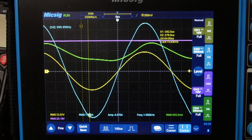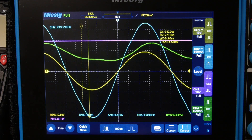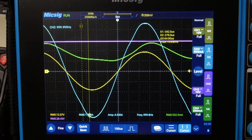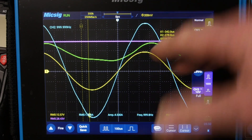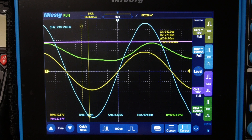The green channel at the bottom is the current from the lab power supply. I've dropped the voltage to right where it just starts to affect the THD — at 29 volts the THD is 0.04%, and at max supply of 31.6V it's also 0.04%. Dropping it to about 28 to 28.5 volts is where the THD goes to 0.05%, so that's where it just barely starts to be affected.